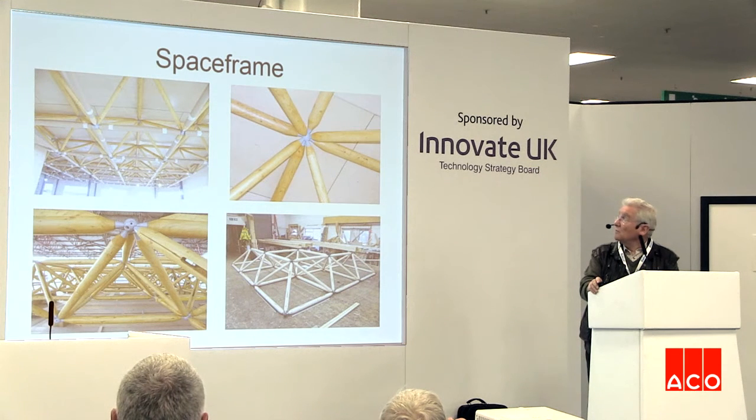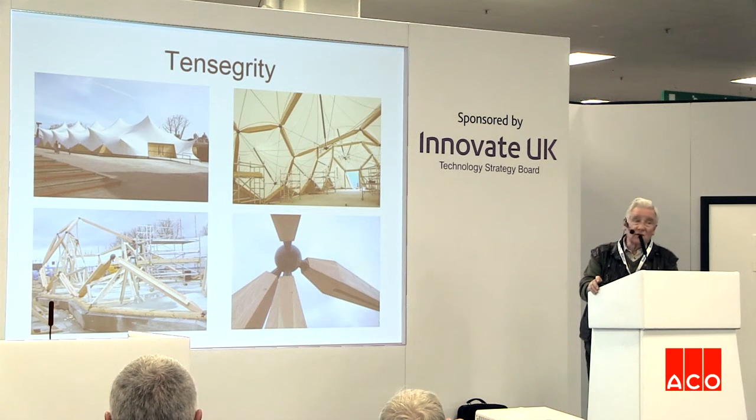We've done one space frame project — that's 100 millimetre and 80 millimetre diameter round wood. The last one is a tensegrity structure where the stiff members are not in bending, they're just pure compression, and the ties are configured to triangulate the structure, giving a much more efficient structural form. It was originally conceived with stiff joints and considerably bigger ribs. It's a showroom for the Cutty Sark while it was being refurbished.